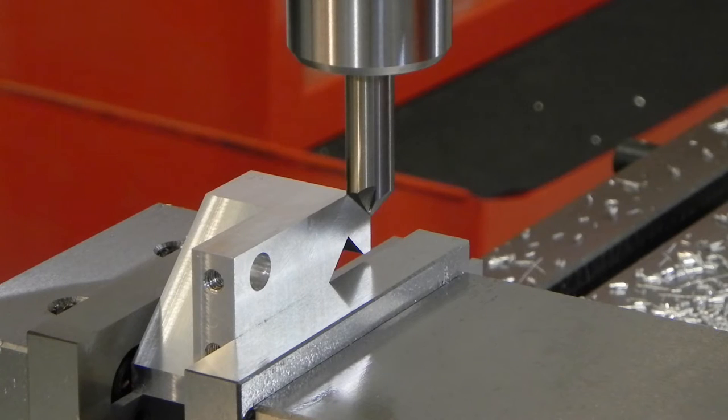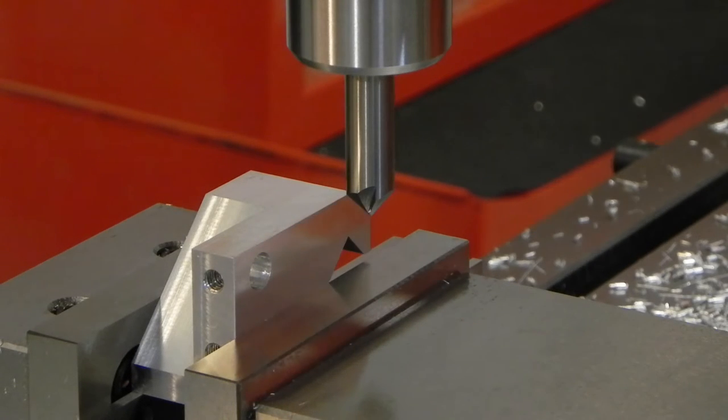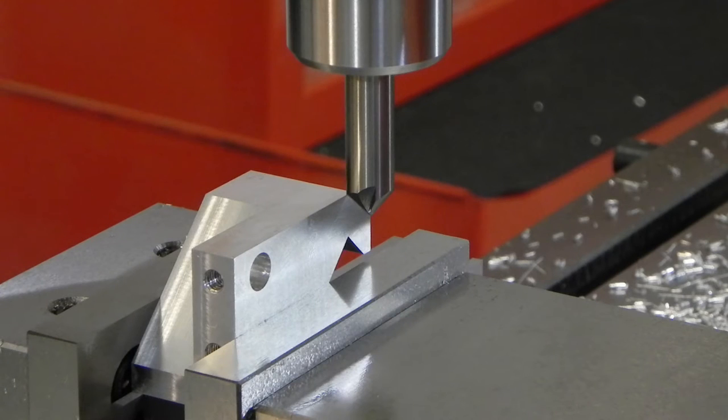The last bit of milling I'm going to do on the actual body is to chamfer all the corners I think my hand might come in contact with. Hopefully it'll make the part look a little nicer and it will prevent me from cutting myself every time I use it. So I just need to touch off here and then feed in and see what it looks like.